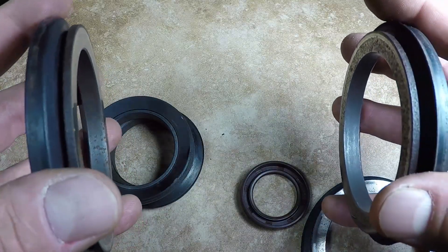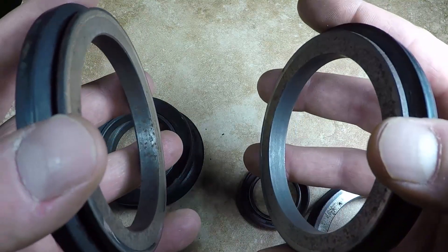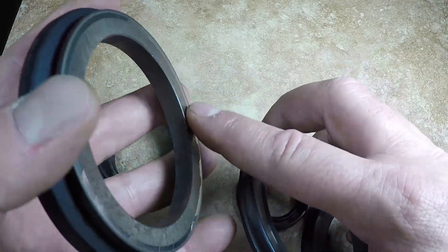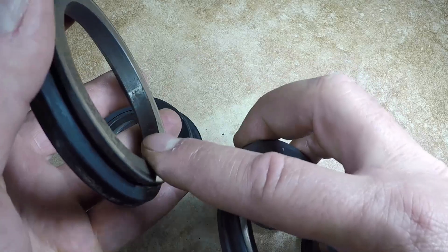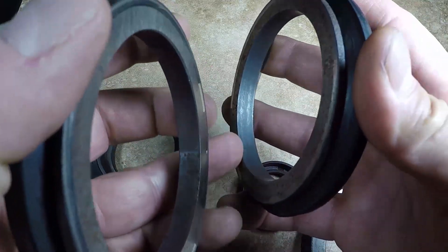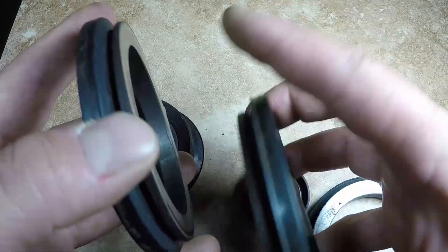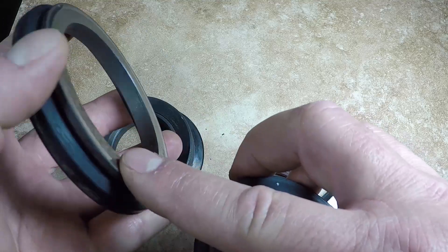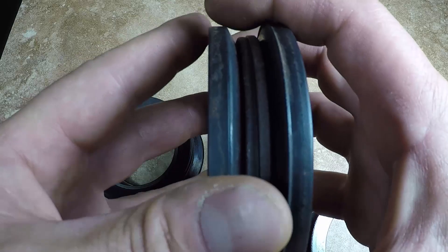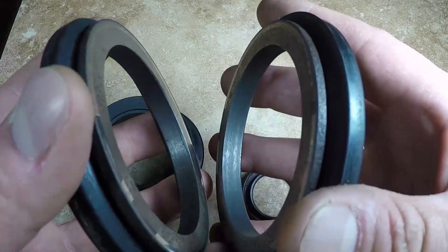Once you're ready to proceed, you need to be very gentle when you insert the parts against each other. Don't use any unnecessary force and don't allow any dust to get on this surface. You only need to apply a thin film of oil between these two surfaces — you could use hydraulic oil or 30-weight oil, just a thin film of oil — and then assemble it gently.